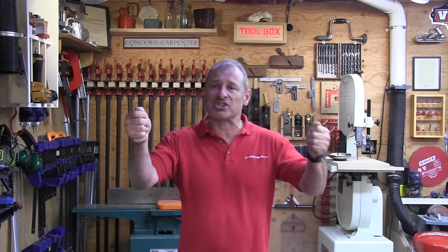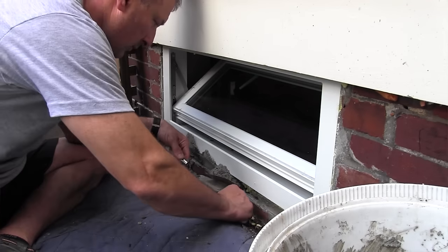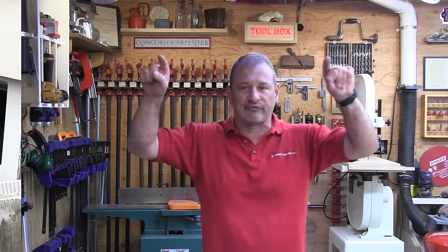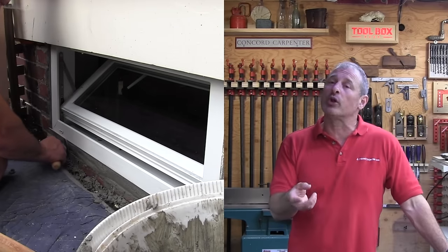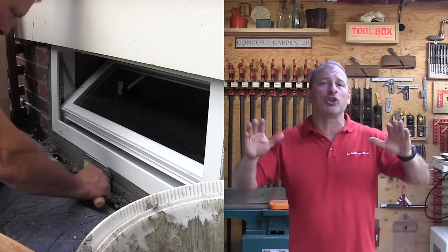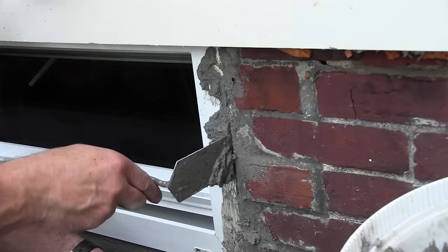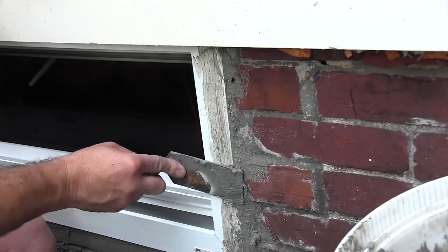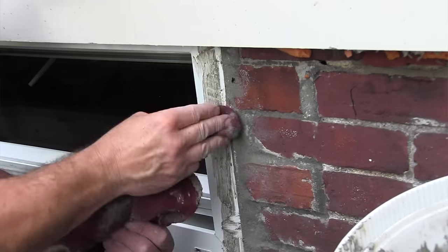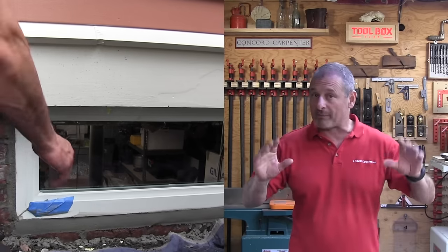Once that's done, fit the sash and check it for fit, make sure it fits right. Then go on the outside and pack mortar into those gaps on the outside of the window, blending to the foundation or just filling in that gap. Smooth the mortar with a trowel, clean off the PVC with a rag, and make sure you slope any bottom edges away to shed water if you have a sill, or just flush it to the foundation. Some windows have weep holes — try not to block those up with mortar. On my first window I did block them; on my second I used blue tape to cover them up while mortaring, which worked great.